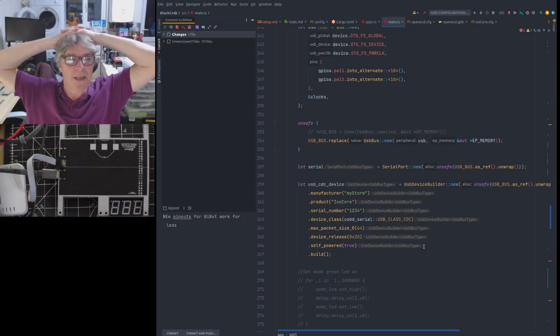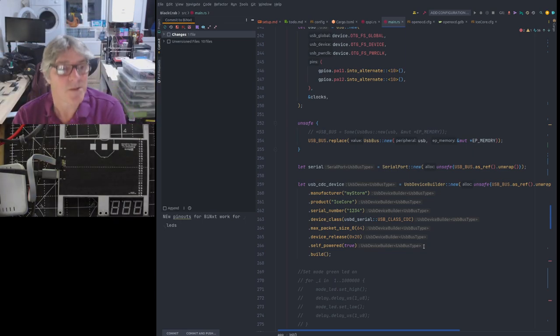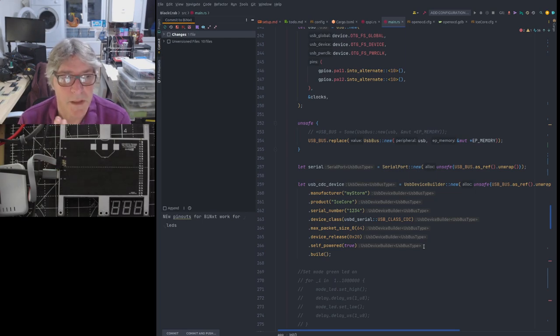Okay, the other pin of the RGB LED on the BlackIce NXT mezzanine board is wired to one of the GPIO pins. If you remember, we had on there an ESP32C3 mini module, which I didn't have, so I couldn't actually fit that. So we're not actually using that blue LED at this point in time. And I'll come back round to my plans for the ESP32 as well. So that's the LED operating and giving us the status feedback on the board.